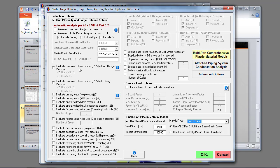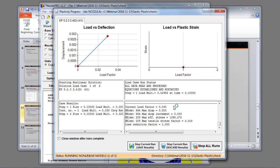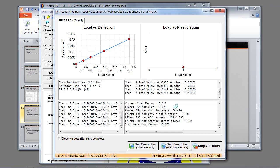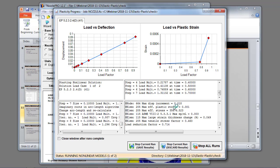These solutions take a little bit longer, so I activate the solution, start the analysis, and run the case. It activates the iterative solver and you can see the load deflection path — a fairly intelligent algorithm that increments the load, backs off, and then increments again as it goes through the full load range. The beta factors are selected based on the design code and it iterates the solution until it either diverges indicating plastic failure, or converges indicating local plasticity with a constrained solution.